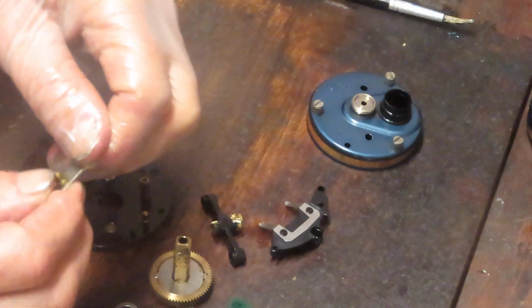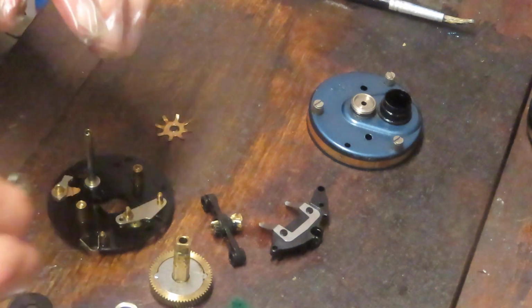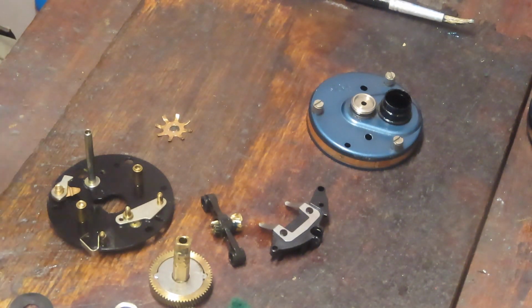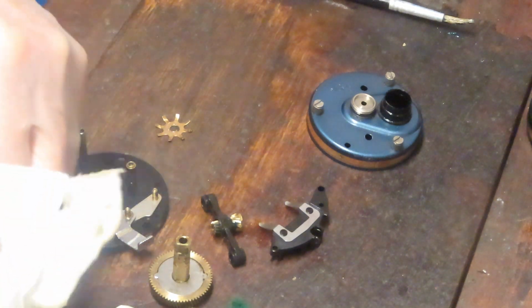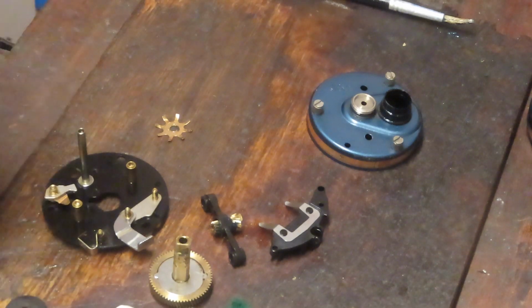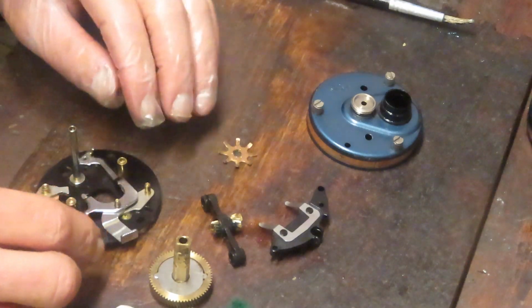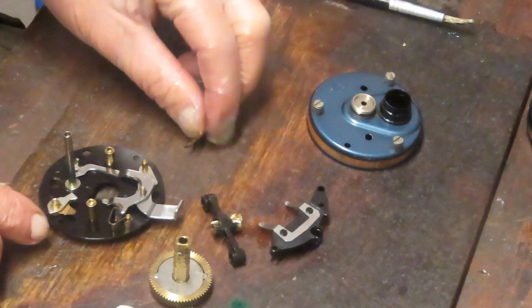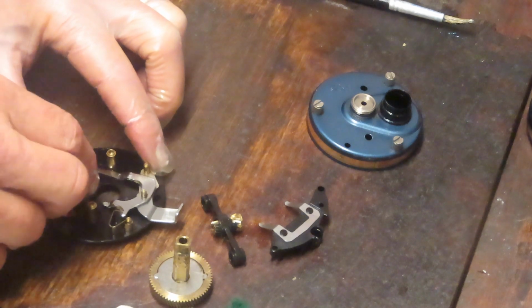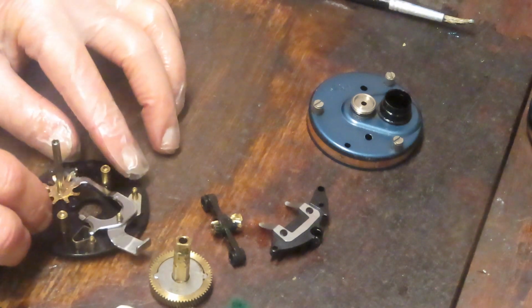First up is this assembly, which is going to guide it. That goes on the post over here. Next up is the free spool release. That's going to ride over the stud here. Last up then is the jack, which is going to be pushed down. It's going to elevate the yoke to go in the free spool, and then it's going to trip back with the other piece. So once you put that jack in play, bring the spring over, then you can set the little cluster there, whatever that cluster is called. I'm going to just swing this out of the way for a moment.